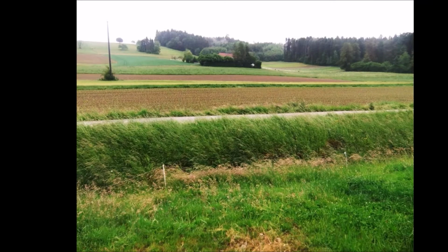Last thing that I wanted to cover is a little bit about fence loads and what they are. The image here shows a fence through high vegetation, and every single blade of grass that's touching the fence represents load to that fence. Other things that can load an Energizer are broken insulators or older insulators with moss and mildew on them, or perhaps old wire that's been left in the field and has got tangled up in the fence.